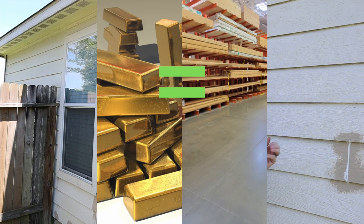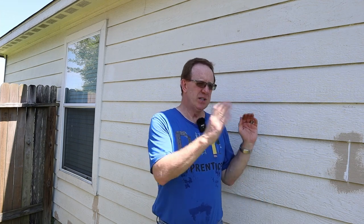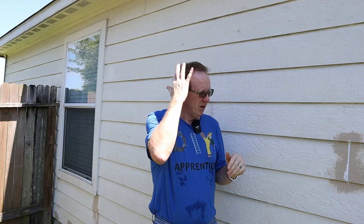I thought about stripping all the siding off, all the molding, getting OSB put on here, and replacing the siding and all the trim. But there are two problems with that. The biggest one is price — right now lumber is as high as the price of gold. And two, when I put the OSB on, I'd have to take the windows out because they sit on top of the OSB. Then inside, you'd have a gap all around the window where there's no sheetrock. So I'd have to do sheetrock repair too — that was just too much.